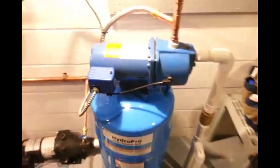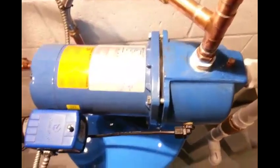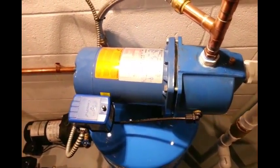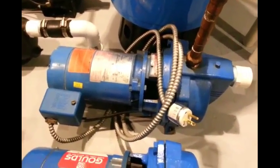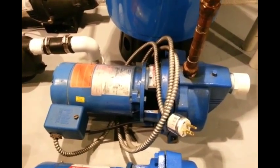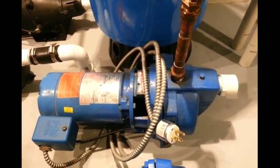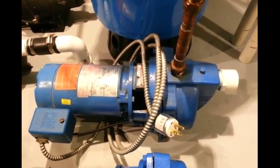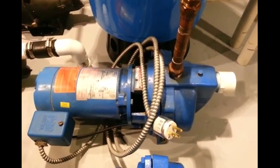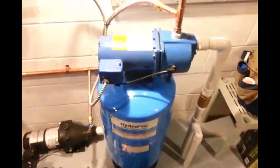This one here is a 2013 that I got on Craigslist. I had it hooked up to a well I had just put in with a pair of PVC well points, so it actually pumps a lot faster than where the old well was hooked up with the 2003 pump — because the screen was obstructed and clogged, and there might have been some cavitation going on. I did pull that pipe and screen out of the ground and they were okay, a little clogged but still functioning. It was still pressurizing the tanks and serving the house.